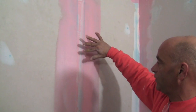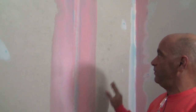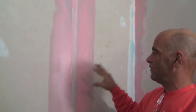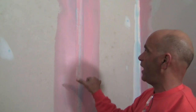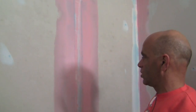You can see the blue of the first coat underneath and the second coat building up. Depending on how bad the hump is, you may have to keep doing this throughout the project to build it up going way further out. Our actual third coat will use a much wider knife so we can start covering the tape better and going out even further for complete coverage. Now we did all our taping for the second coat — we also want to tape up the nail holes one more time. The second coat is done the same way as the first.